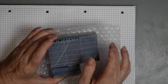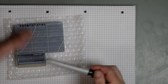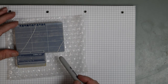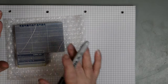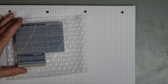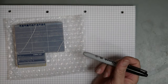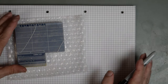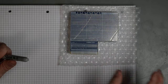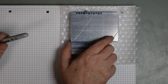So this is a prototype cartridge development board. It plugs into the cartridge port of a Commodore 64. We have got all the data pins, the address lines, everything that you would normally use to build a ROM cartridge, a game cartridge, something like that. That all comes out onto this breakout here. If we wanted to, we could build a ROM cartridge game with this, but we want to use some I/O. We want to talk to one of these, and we can do that, because there are two lines on this interface, and you may be able to see them here and here.